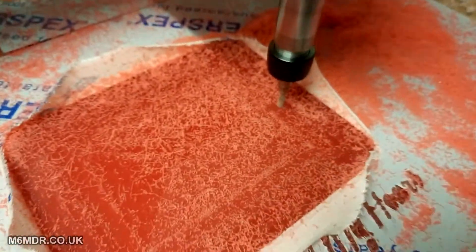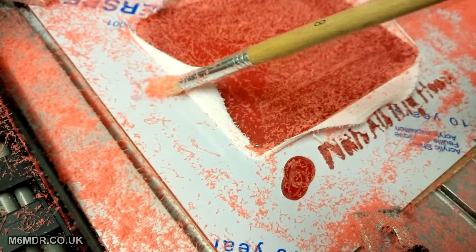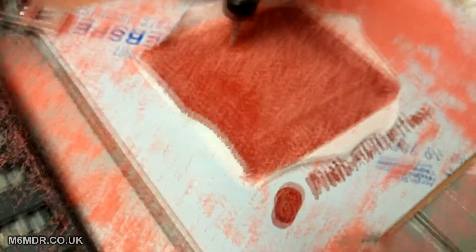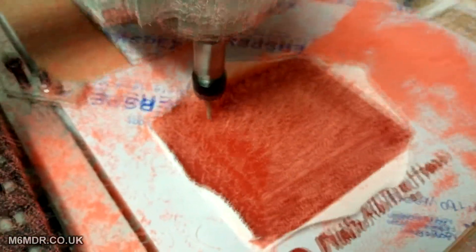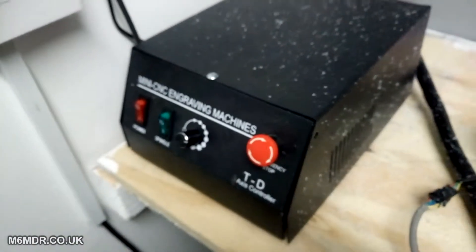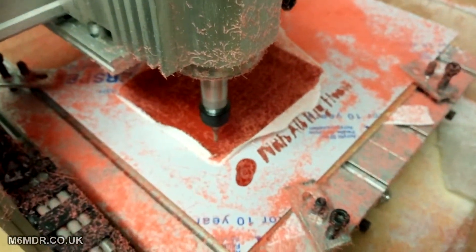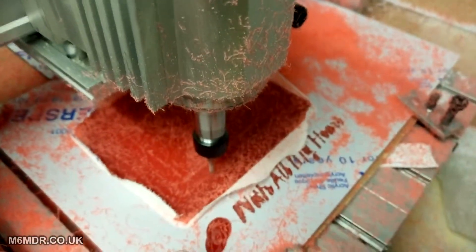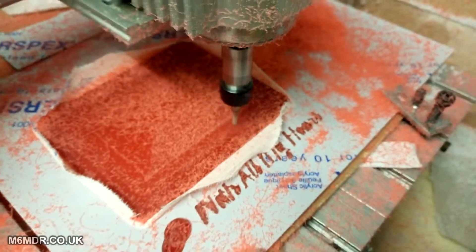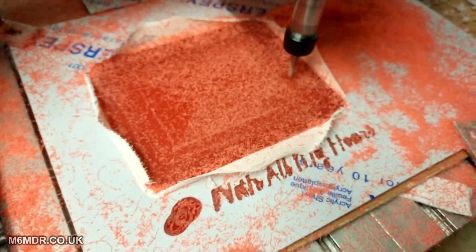I've had a couple of attempts at this and I've even broke one of the end mills — it tried cutting too deep on the last attempt for the outline, got stuck, raised the whole piece up, snapped the bit and a piece with it. What initially caused that was me playing around with the spindle speed dial — I turned it down a tiny tiny bit and that was enough to turn the whole spindle off. Of course it was trying to carry on with its XY movement at the same time and snapped a bit. So I'm a bit more cautious now on this one.